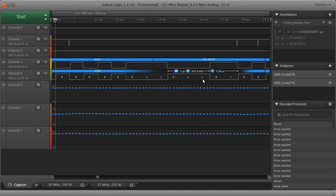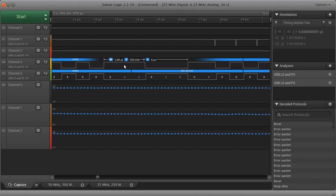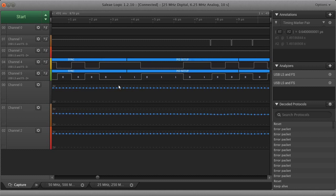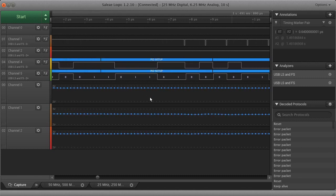Oh, hey, that's actually how they do the decoding down there. That's kind of cute. So this 0 and 1 is actually legit. At any rate, because it's the same bit, we now know it's a 1. And that's called NRZI encoding. I don't really want to go into why that is a thing. At any rate, once you see the 1 here, it indicates it's the end of the sync byte. And now it starts transmitting data.